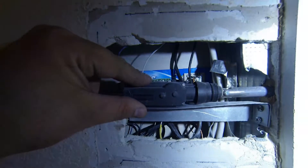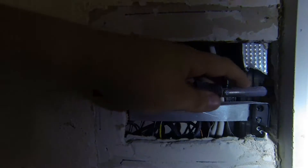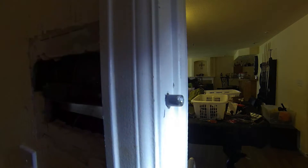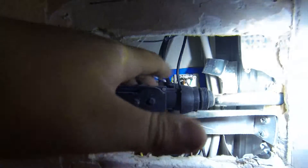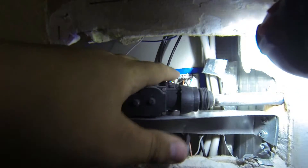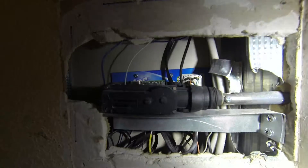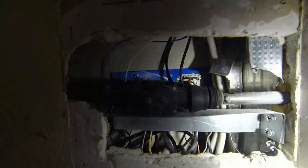This is a car unlocking device. This is a half-inch steel rod which I cut a slot in and drilled a hole through so it could attach here. I also beveled the end a little bit on the angle grinder so it would have an easier time getting through the door. In the back we have an H-bridge that I etched, and a Raspberry Pi with a Nintendo Wi-Fi dongle. They're mounted on a piece of cardboard from a Ziploc bag — it's non-conductive and semi-rigid, so it works fairly well.